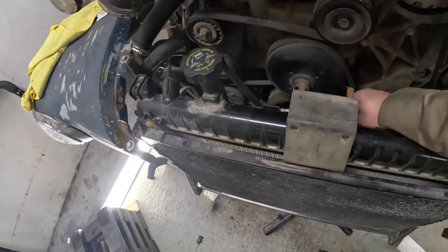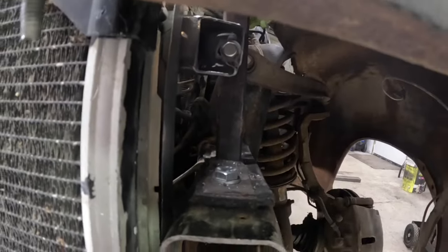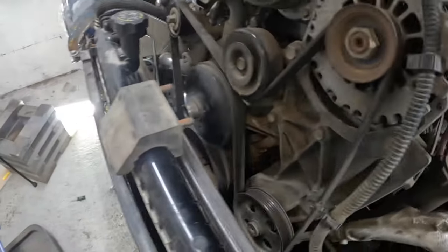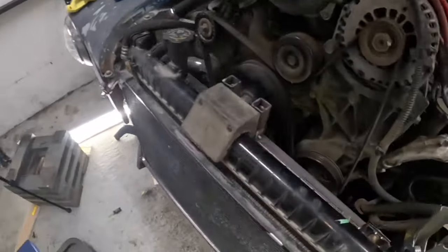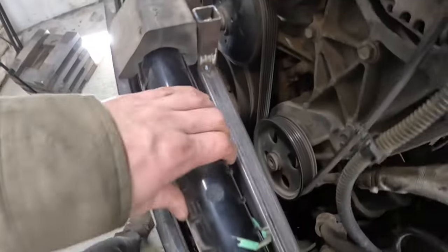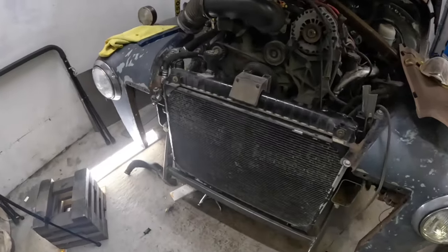This is just a piece of scrap and it's a little too short. So I got that bar cut — you can see it's bolted in there, bolted across. Now all I got to do is make something come off these metal tabs, weld it back to the bar, and then the rad will be mounted. There we have it — the whole rad's mounted. All I did is take some square tubing, welded it to a crossbar, drilled some holes in it and those pegs in there, just threw a tack on there for now. So this bar will be removable if I ever take the rad out. I didn't film anything because the camera was going to die, but yeah, that's a wrap for the rad support.